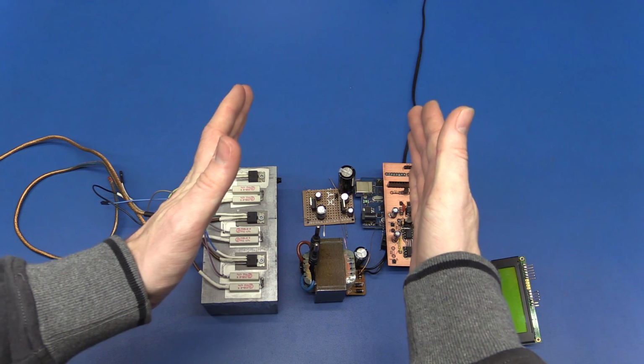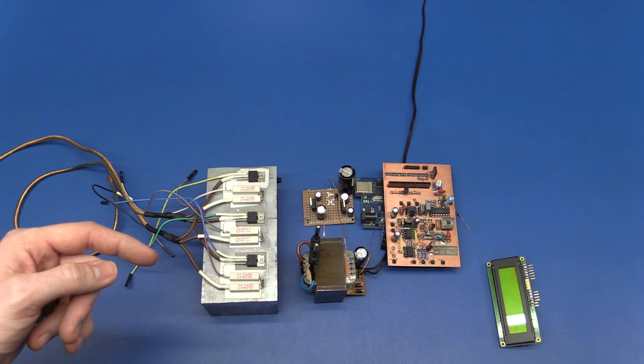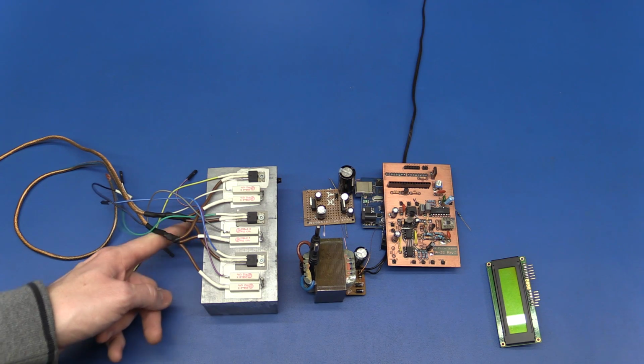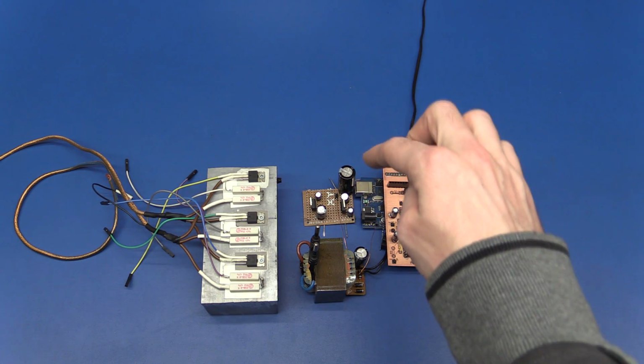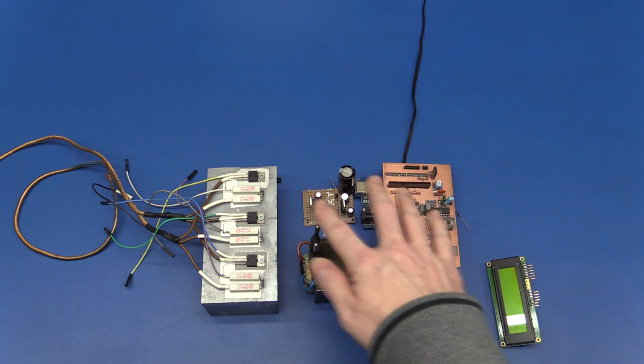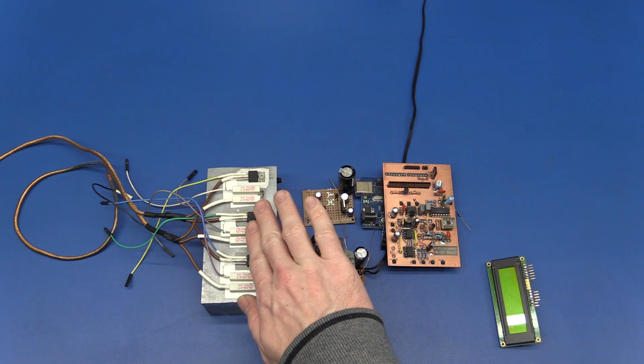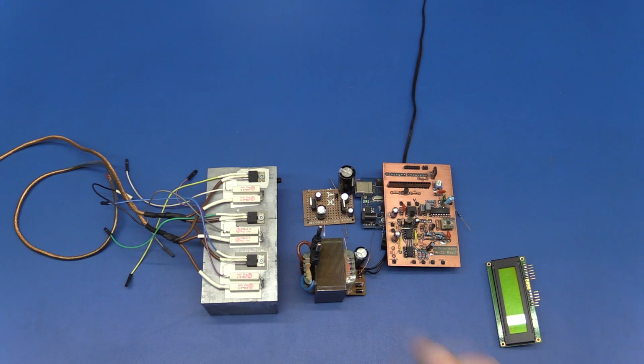And to cool the whole thing, I'm planning to put a fan right in the middle of the box and then make venting holes behind the heatsink. So we'll kind of force the air down through the box and cool these components first, and make sure that the hot air from this is not going this way but that way.